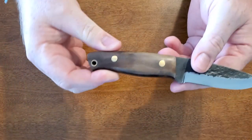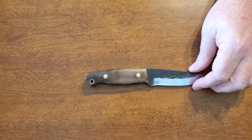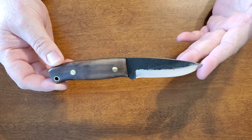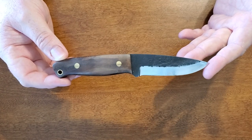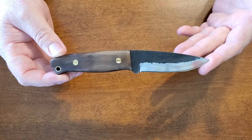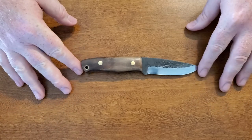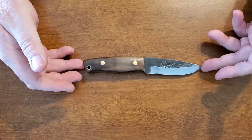Brass rivets, really nice beautiful walnut handle. Steel is 1095, which is a high carbon steel — not as tough as other steels, although it's got just under one percent carbon content, like 0.95 percent. It's not as tough as others because it's a little low on the manganese, which is used as a hardener. I could go on about 1095 but I'll leave it at that — feel free to Google it if you're not familiar. It's one of many favorite steels in knife making.